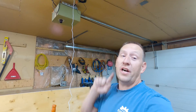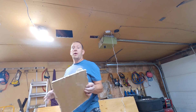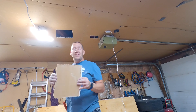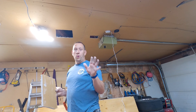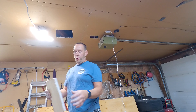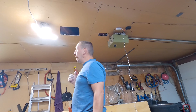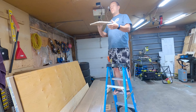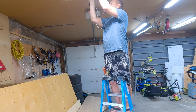I've got a unique situation — my garage door opener has been drywalled into the ceiling, so the electrical plug would normally be right there as a regular 120-volt outlet, but it's not there. It must be up above the drywall, so I need to cut out the drywall to find where my power is. I cut out a big hole — it's just as easy to fill a big hole as a small hole. Now the box is plugged in and I can patch the hole.